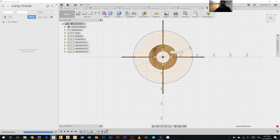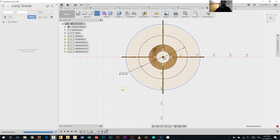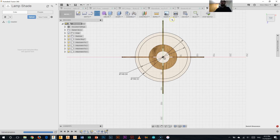To start my sketch, I'm going to use two circles like we did on the attachment ring — one and two. I've got my two circles. Let's double check the dimensions: radius 74.02mm. We'll go dimension — D on the keyboard — select the ring, and type 74.02 multiplied by 2, because it's a radius we need to convert to diameter. Hit enter — there's our inner ring. For the outer circle, 168.02 is the full diameter. Hitting D again, selecting that outer ring, typing 168.02, enter — and there's my inner and outer rings.